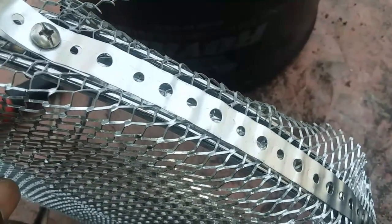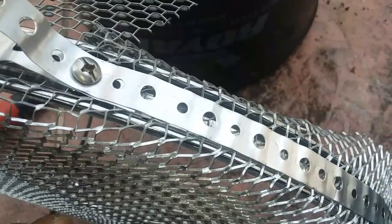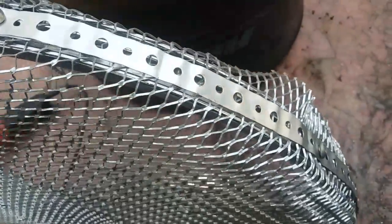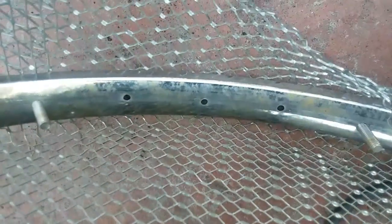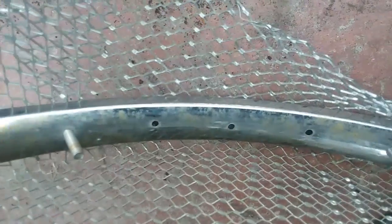I drilled the holes the next size down from a 1/4 inch, so when I screw them in they actually catch and hold it, and so I don't have to use nuts on the inside. I did that all the way around, and what I did was I skipped 3 holes. Every 4th hole I drilled bigger so that I could put the screw in, because those holes aren't big enough, but these holes are. And so I'm almost done here, but I ran out of tape.